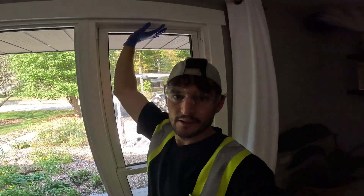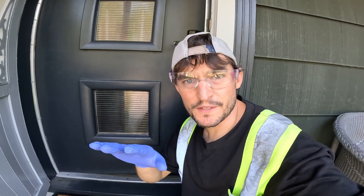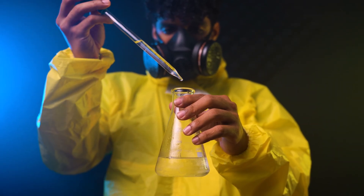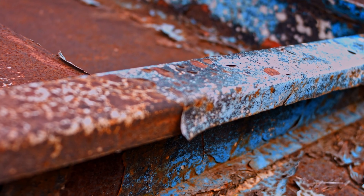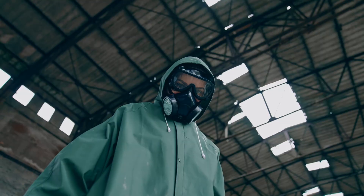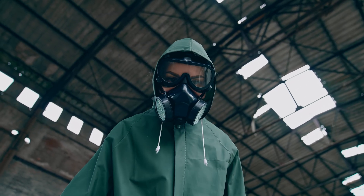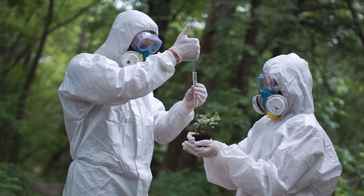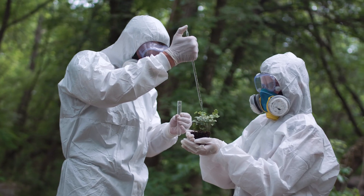Make sure you're not wearing any clothes you don't want to get bleached. This is my bleach hat — make sure you wear your PPE. Make sure to check all your windows are closed. If you're doing this professionally, always ask the homeowner if they know of any leaky doors or windows. Sodium hypochlorite is a powerful chemical — it can damage certain surfaces, so you must take precautions. Avoid getting SH on bare metal, wood, and dry plants. Cover or soak and rinse off these areas before, during, and after. If you're unsure, always test a small inconspicuous area first and rinse well with plenty of water. With a cautious approach, you'll be fine.